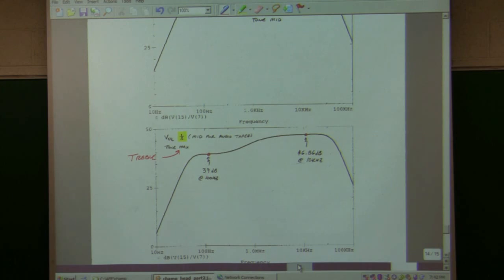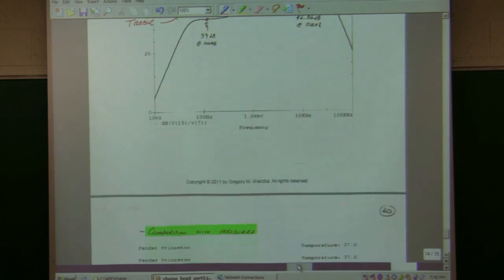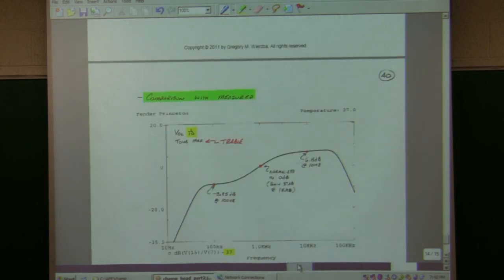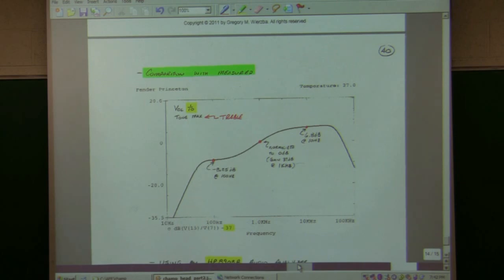The next thing to do is to start to analyze the circuit, figure out how things work. If you're in 202, there's a supplemental problem where I do a tone control, figuring out a bass and a treble. Not this circuit, but a different one. But the methodology's in the course, so you can do that kind of calculation. And lastly, I put it way down to 1/10. And you can see it's very much treble and very little bass.